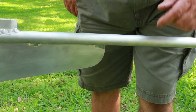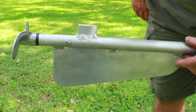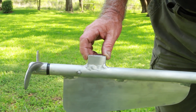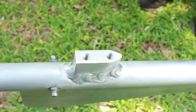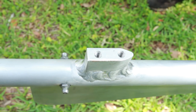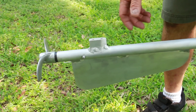On the bottom of this aluminum tube, we welded a skeg down here. Also at the top, we welded a little plate. This plate actually has two quarter-twenty holes tapped in the top of it, and you can put an anti-cavitation plate on there, or whatever the proper name is for that.